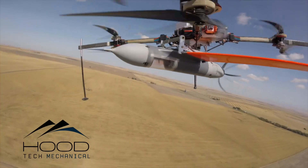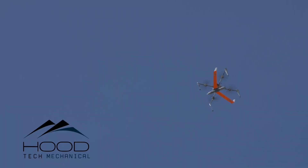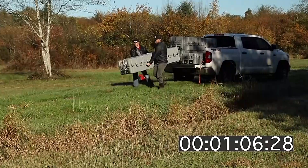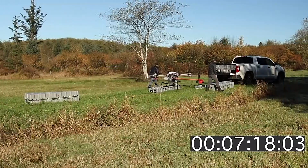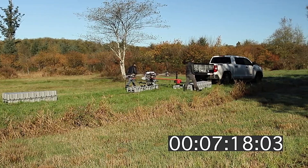Who are the customers for this product? The most demanding customers are the ones that want it all. They want long endurance surveillance — ISR. They want low detectability, so it's a small ISR platform: 10-foot wingspan, 2 horsepower, not these monster UAVs. They want VTOL, and they want it to fit in something small like a pickup truck — small footprint. They want to be able to get it there and get it home without filling a C-130 cargo aircraft.